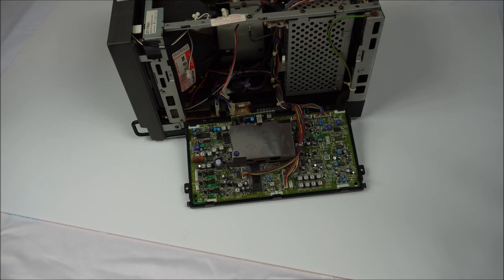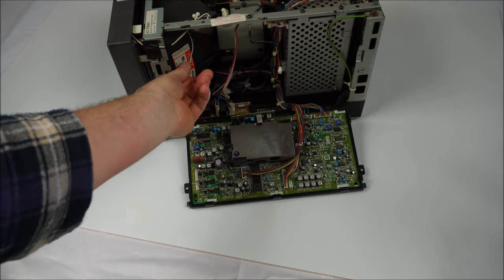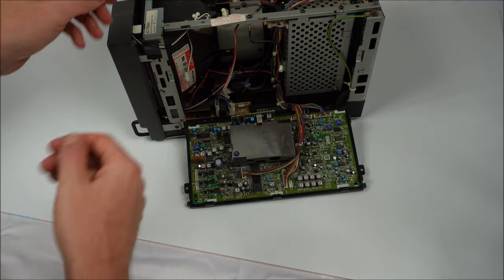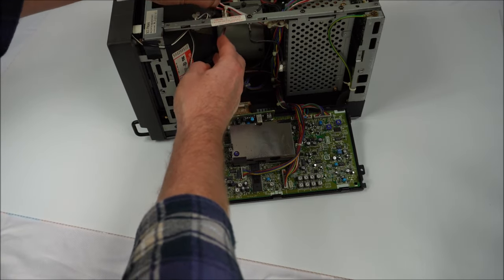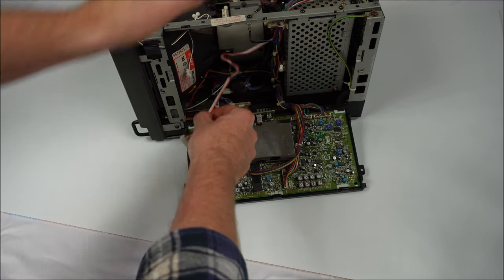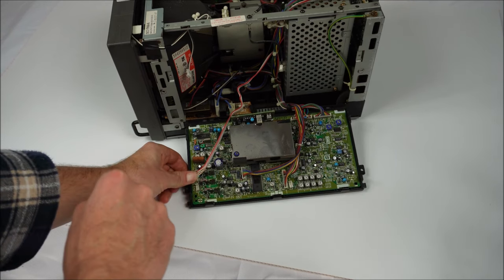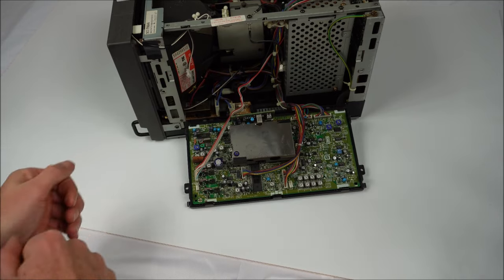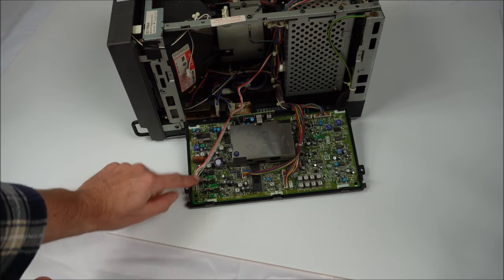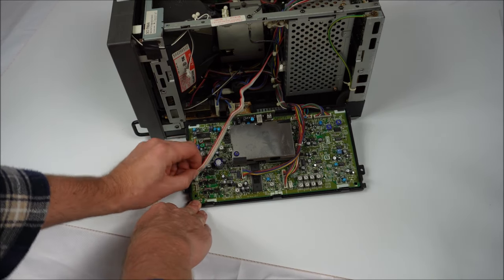If we wanted to, we could operate the monitor with the PCB down. It's not necessary, strictly speaking, to have that ground cable in, nor the tally light cable. But to get the neck board cable to reach, there's a little cable clip at the top here on the crossmember bar. We can take it out of the clip and then plug it in as such. And that would enable the red, green and blue to go up to the neck board. If we don't have that cable plugged in, we won't get any picture at all. But we don't need that in at the moment.